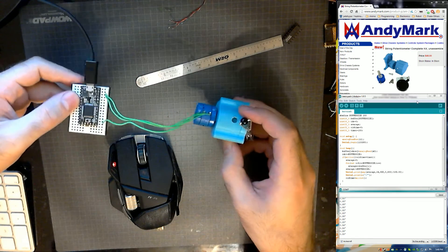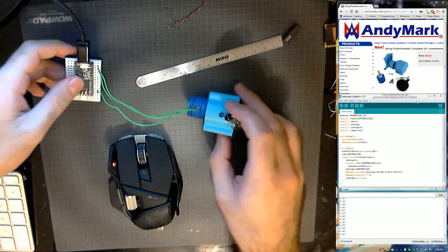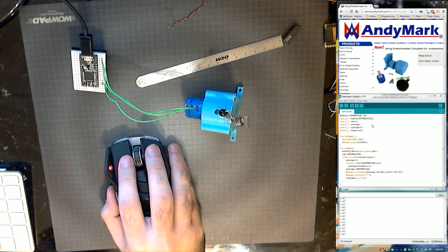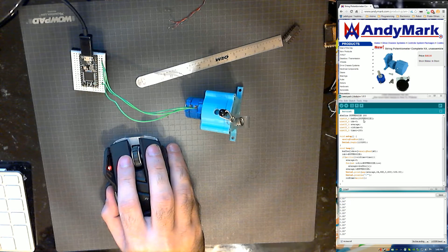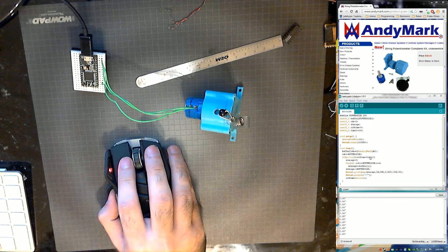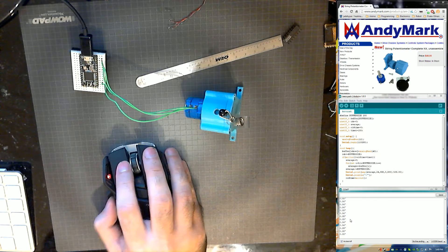As I said, I have it hooked up to a Teensy 3 to get data out of it. On the right side I have my Arduino code if you guys want to test it. I just have it taking a buffer size of 200 so it fills up, repeatedly fills up the buffer, and then it just displays the average as you can see down here.